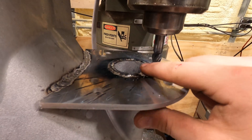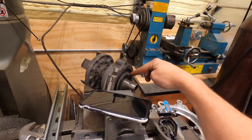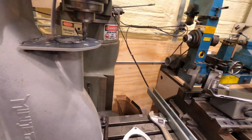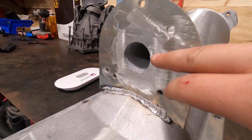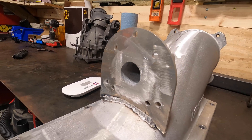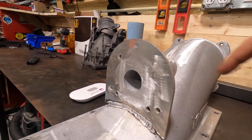Weld around the ring. Now that that's welded, I'm gonna machine this off to where it's nice and smooth, so this rubber lip on the mid-shaft PTO adapter doesn't interfere with this weld. That turned out nice — just re-welded the inside of it and then took the mill to it and ground it down. So now no water can come in and leak through this PTO mid-shaft bearing.